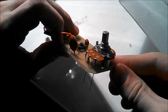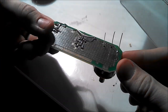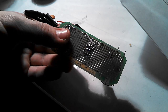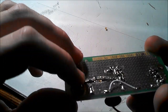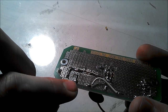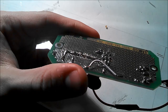I've now soldered the potentiometer to the protoboard, placing it in the middle at the opposite end from the photodiode. It just took three little solder joints. I successfully connected the potentiometer to IC pin 5 through a 1K resistor, soldered in a straight line. The other pin of the potentiometer is soldered right to the ground bus. The remaining pin is plus 9 volts, which I'll connect when I connect the battery.